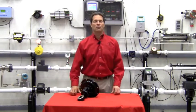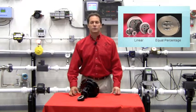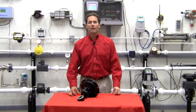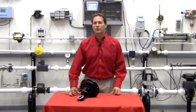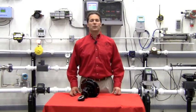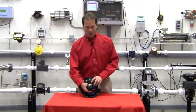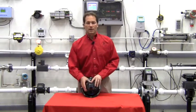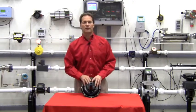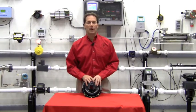The Mark 75 is available in either linear or equal percentage flow characteristics to suit your particular needs. Have you ever experienced body wear issues in your control valves due to cavitation and turbulence? The wafer style design virtually eliminates body wear issues. There is no valve body to wear out. Simply install a short section of pipe downstream of the Mark 75 control valve and let that short section of pipe wear out instead of your valve body.